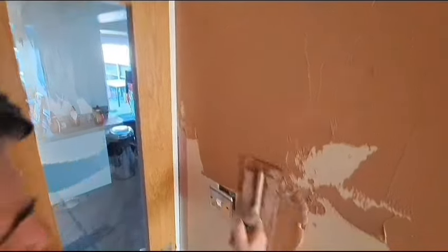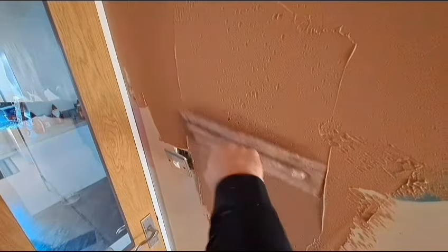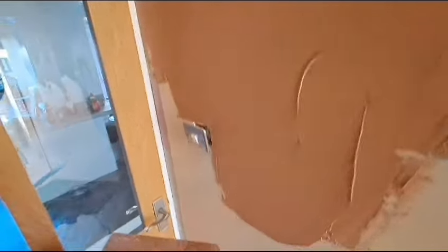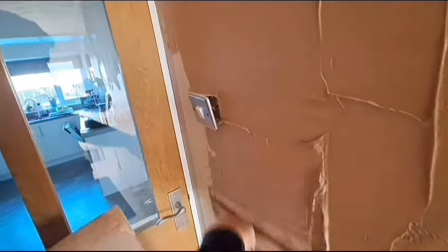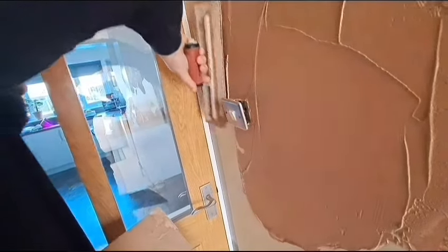Before I get too far across the top, I'm just going to switch back quick and show you how I get around the little light switch. Be careful not to get any plaster inside the box — if you do get a little bit in, it won't matter too much, just pick it back out. Make sure you turn the electric off. In some circumstances it might have to stay on, but maybe wait until you're a bit more skilled with the trowel. We tend not to turn the electricity off in customers' houses — I've just got to be really careful when I'm in there with the metal trowel. One little touch of one of them wires, and it'll be half a day out of the undertaker.